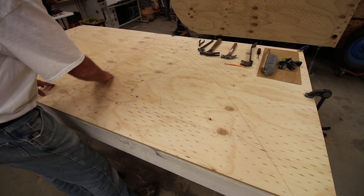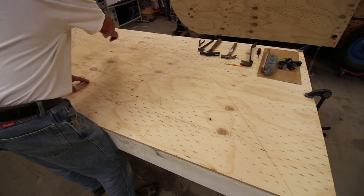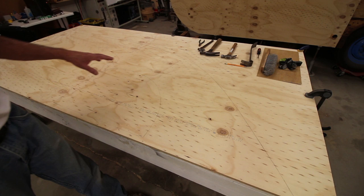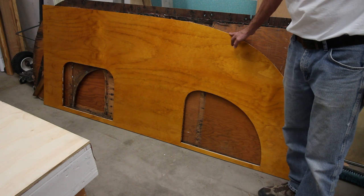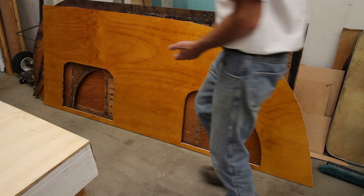As you can see, I got the window traced out here — this is the rear upper piece. I've got the outline of the radius all transcribed onto here, so all I've got to do is get out my jigsaw, cut out the window, cut out the radius, and this piece will be ready to be sanded and shellacked. This is the back side — the good side is what we'll be shellacking. This is the upper rear piece, already sanded and shellacked and ready for installation, but I've got to get the bottom piece in before I can put this piece on because this piece sets on top of it.